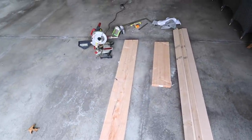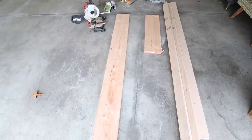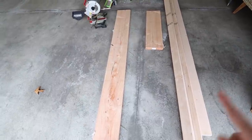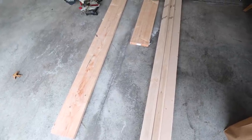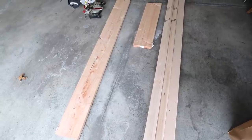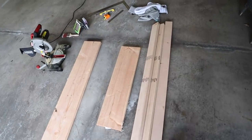I am not fancy. I literally sit on the garage floor and make my cuts — it's comfortable and it's easy. I did have them cut at Lowe's this two by ten down to seven feet because I just didn't want to have to mess with it. So this is already cut down to seven feet. I need to get these two by fours cut down to 27 and a half inch pieces and I need eight of those. And then I have some extra that I need to make the brace for the top with. My braces are getting delivered today from Amazon — the brackets.